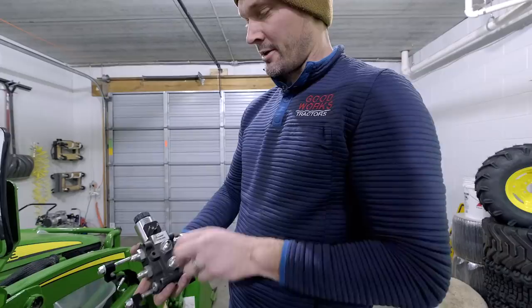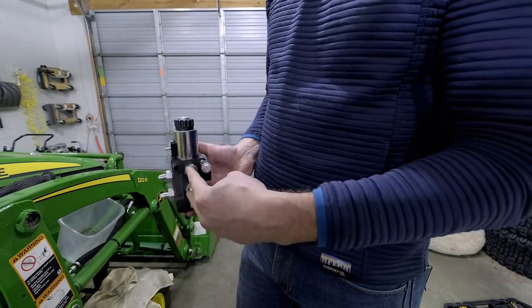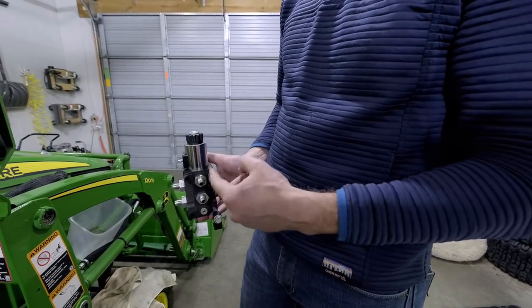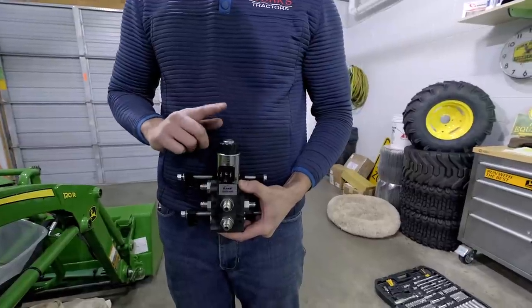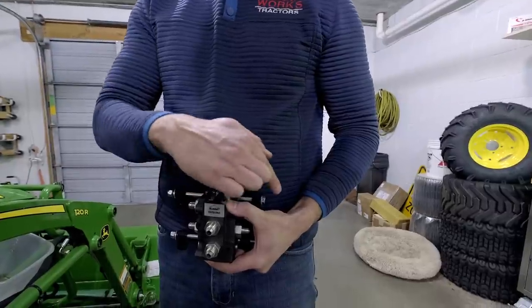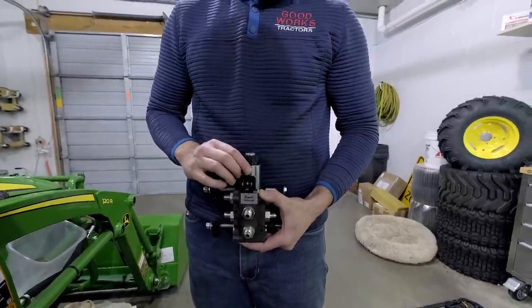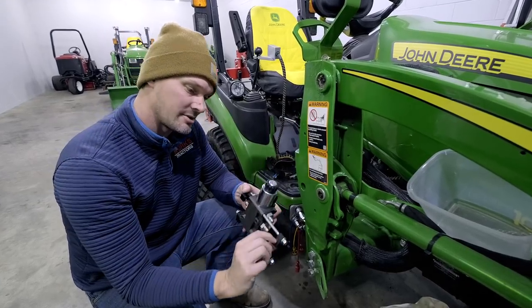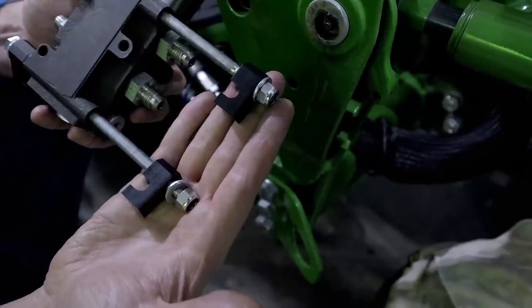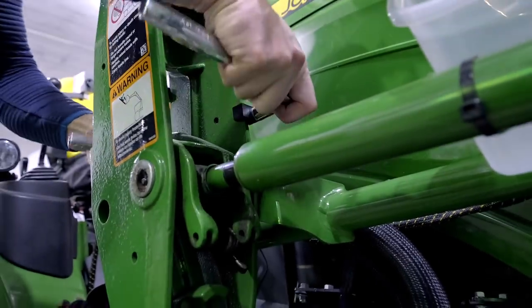This is our diverter kit body with a solenoid on top. It mounts to the inside of the rail. Incoming flow comes in here, and in normal operation mode it just passes right through to the curl roll function on your loader cylinder. However, if you trigger the solenoid by pushing the button, it redirects that flow — instead of going straight through, it takes a 90-degree turn and continues down these hoses to your grapple open/close function or hydraulic angling blade. It clamps right to this section here — don't over-tighten yet as it needs to be adjusted after hoses are connected.